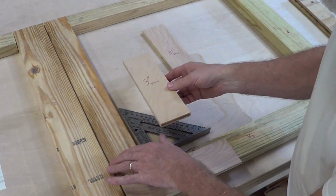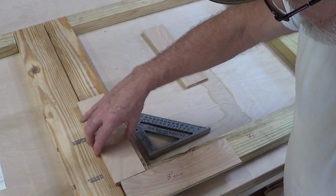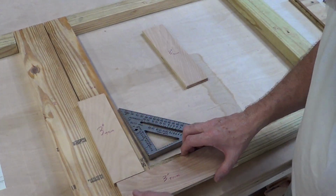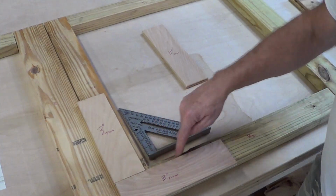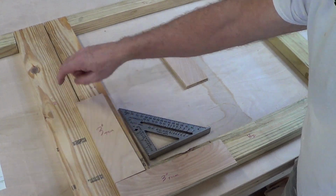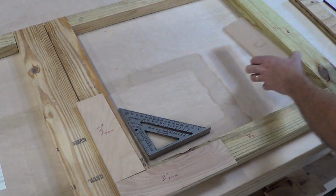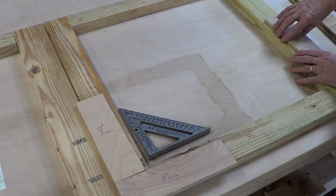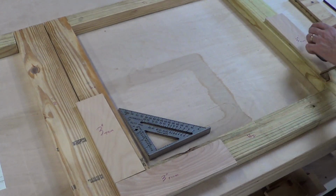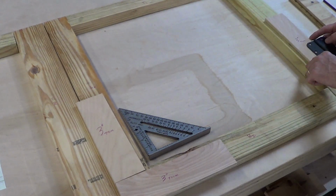All right. And over here, this door hangs over onto this door a little bit, as it kind of stops up against that, and it's got a space here. So this will actually go like that. All right, so you got stop space for the inside door, and this is overhanging onto this door. All right, same thing over here. You can see over here. Now we're flush trim on this edge, and that's because this is the side that it's hinged on. Right, so this has to be flush, but we still have our inside space for the inside door stop.